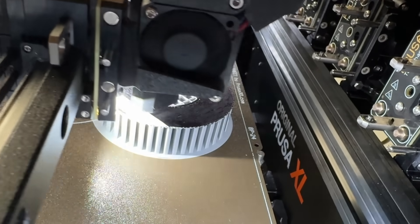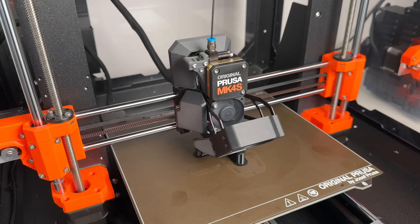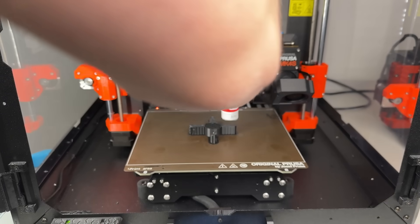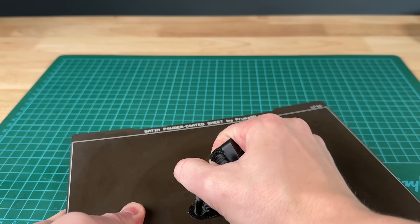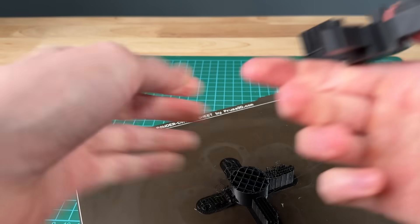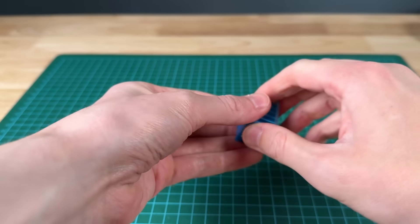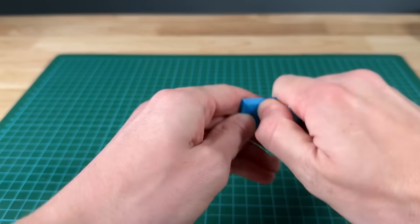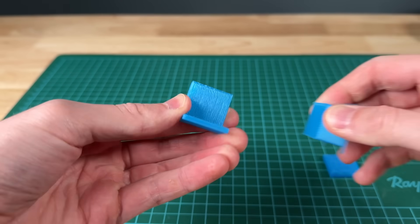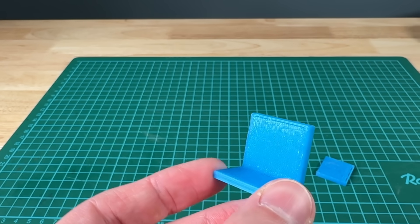I also did some more test prints with glue stick, permanent marker and hand cream. One thing I wanted to try out was TPU — I printed a test piece from TPU and applied glue stick at the support interface. Removal went okay, but it seems like I applied too much glue and the part broke in half. I think TPU supports might deserve a dedicated video — let me know if you'd be interested. Here's a comparison between PLA with a 0.2 mm top contact Z distance (regular support settings) and 0 mm distance with hairspray as a release agent. While the removal was similarly easy, the bottom surface of the part with the release agent looks noticeably better.